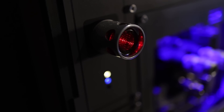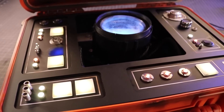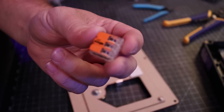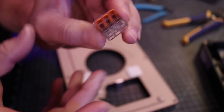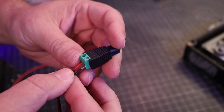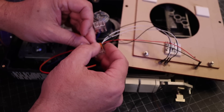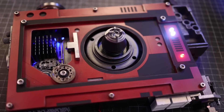I've used these pre-wired LEDs for years across so many projects. For me it's a cleaner and faster way of doing things versus using a breadboard, individual resistors, and soldering everything together — I just don't have the time for that. We can wire up our pre-wired LEDs using Wago clips instead of soldering all the leads together. These clips let me land the LEDs easily on both the positive and ground of the circuit, so if I need to replace an LED I can do it quickly and easily. Then I wire up the leads from my power supply and the project has life.